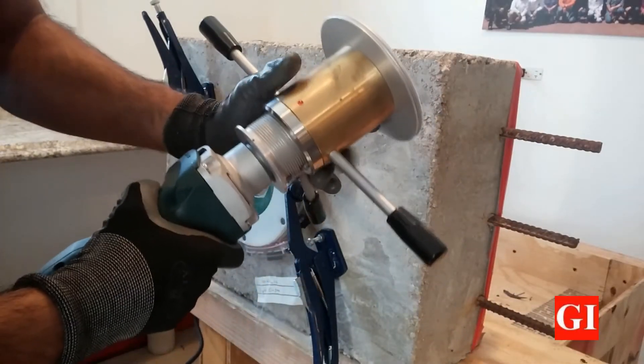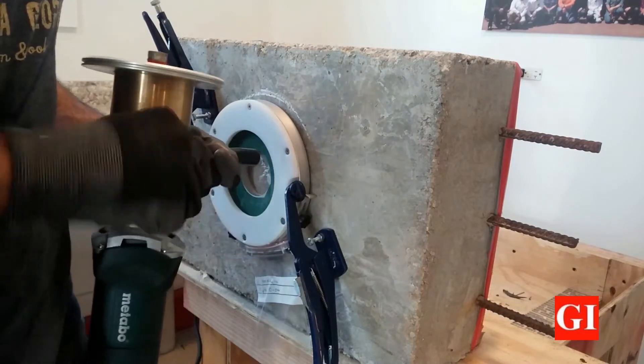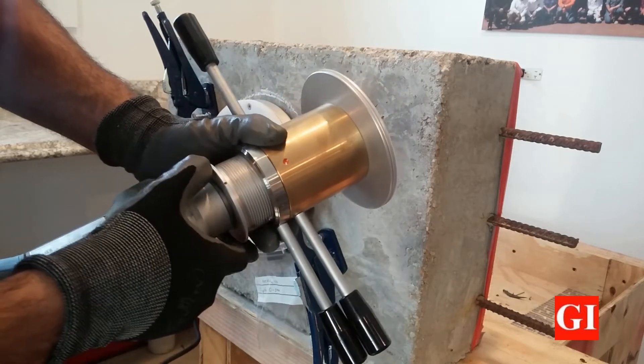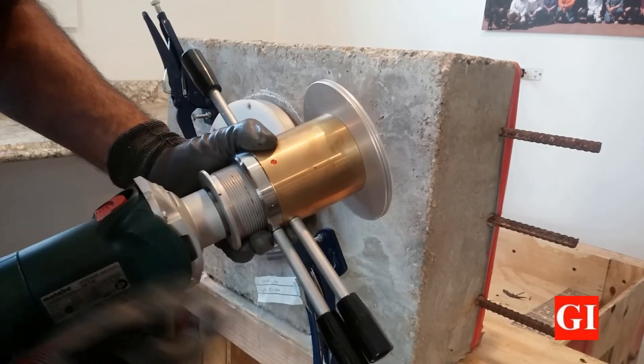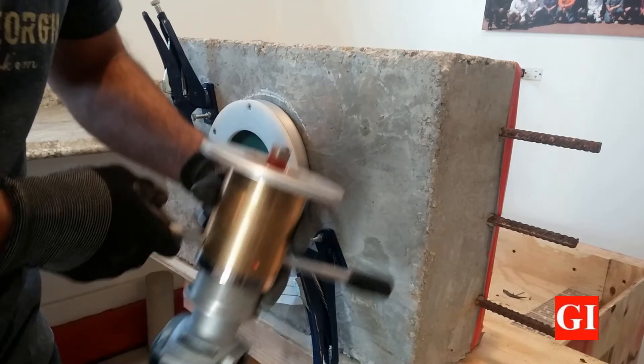This concludes the zeroing process and now the unit is ready to test. The pitch of a complete thread turn is 2mm. By rotating the grinder collar 90 degrees, the bit will advance 0.5mm, which is the maximum recommended increment. Always lock the grinder collar after every turn.